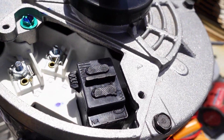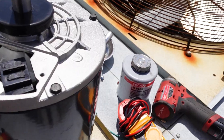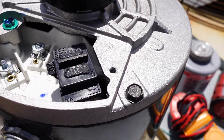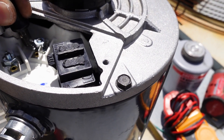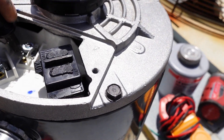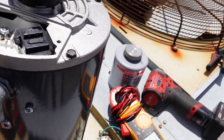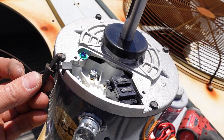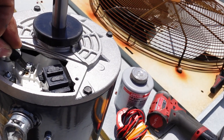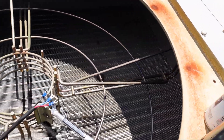We're going to loosen these bolts — it's 9mm or 11/32. There's also a lock washer you've got to pick up. One thing somebody showed me was you can take a magnet and manipulate that lock washer to get the fork connector. This is just a Malco magnetic drill bit with the driver removed — you can pick up the washer in order to get the fork connectors that I've crimped on there underneath.